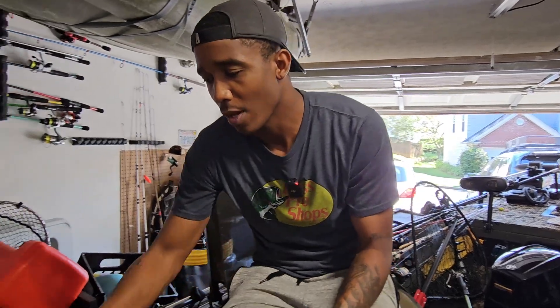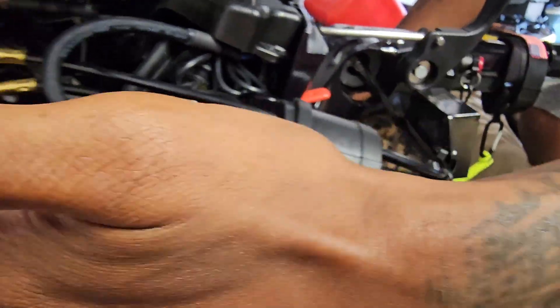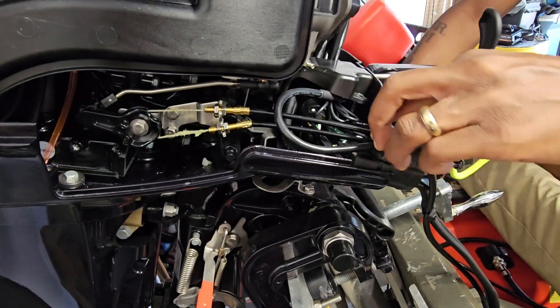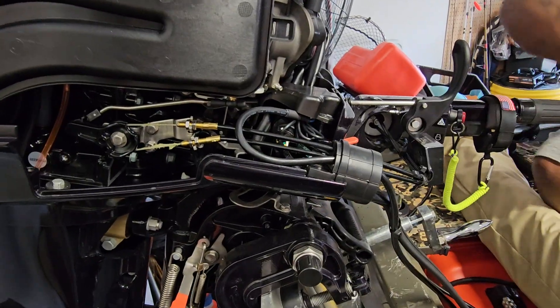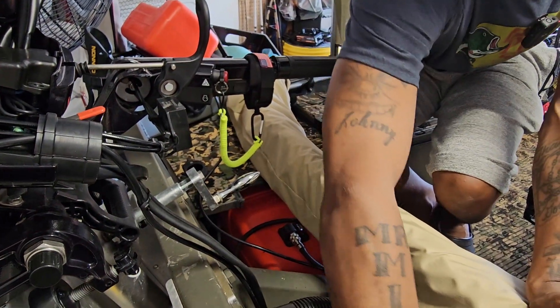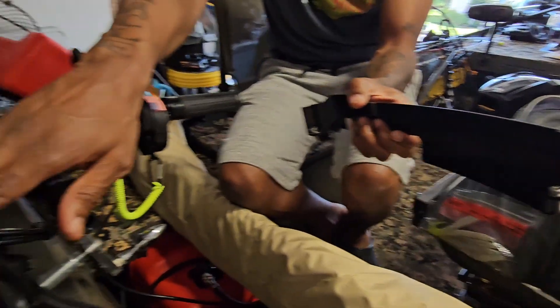So this is a very important piece right here for you guys — anybody who couldn't find it, because I had a hard time finding it. But Eric with Golden Channels really helped me out and told me exactly where it's at. It's super easy. I thought I'd have to use a flat head screwdriver and remove all this stuff, but I didn't have to. To actually run my wire I did need to use a tool. Where you're going to find the wire — I ran it through these little grommets, these little keepers right here. I actually removed the side portion so that you can easily access the wiring, the wire loom to run it. And that fits right here on the side, right over the top — it bolts back in right on the side. You just remove that with a 10 millimeter socket. That's all I needed — it's two bolts right down in there.